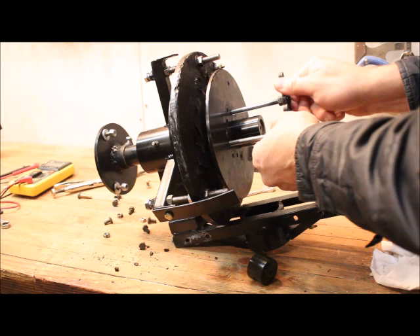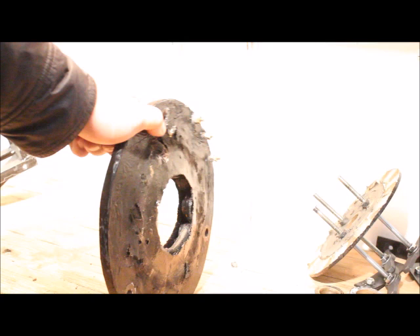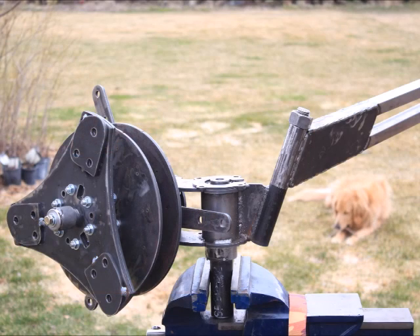Here's the previous one that I had up there. They look identical — they're kind of clones of each other. This is the one with the Missouri blades that I had on it. Mechanically, everything made it, but I roasted a stator with it. And you can see the destruction there. It heated up so much that the magnets flew off the rear plate. One flew off the front plate. And mechanically, everything else held together, which is amazing.